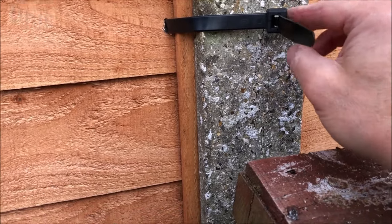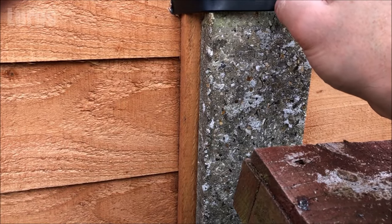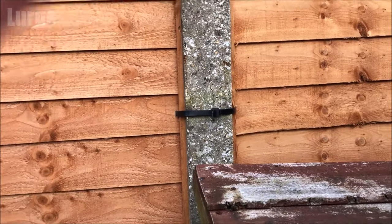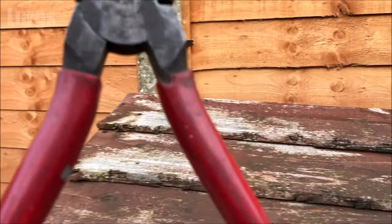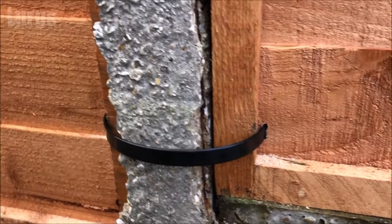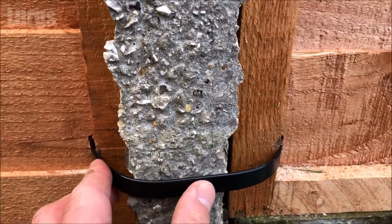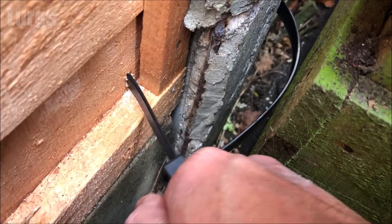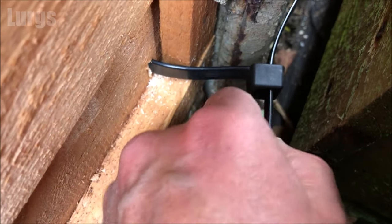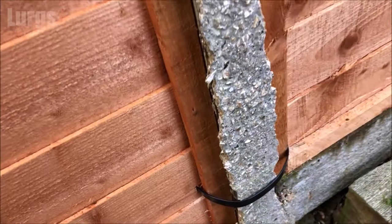You can put in as many of these as you like — one at the top and one at the bottom. I'm putting another one at the bottom: same process, just drilling the holes in the fence panels on either side of the post, feeding the large cable tie through, and tightening it up. You don't have to do this, but it just gives a bit of extra strength and stops it moving about inside the concrete fence post.